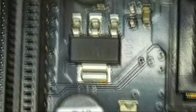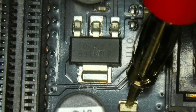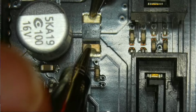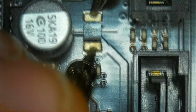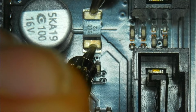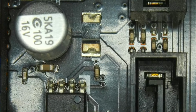And as far as it seems, this fuse has also blown. Let's get you a little bit down here so you could see that. So this fuse, I have no continuity through it. I don't even get an ohms reading. Oh, now I might be getting one. Almost a kilo ohm of reading. So this fuse has also to be bridged.